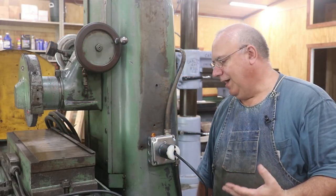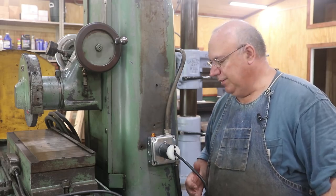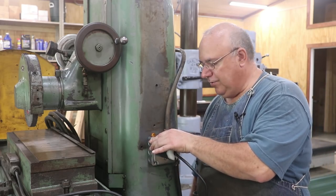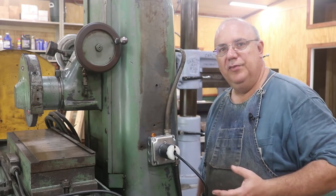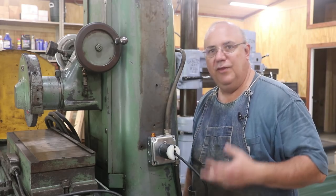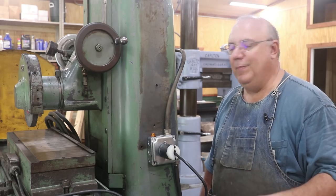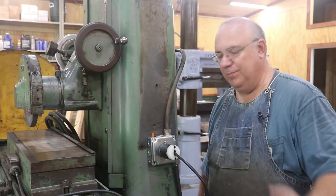First, a fairly minor electrical upgrade — something that's going to make the machine a little bit cleaner and better looking. This electrical box on the side is actually 120-volt direct current used to power my magnetic chuck. When I bought this machine, it had a huge box hanging off the side. Inside that box was a rectifier — an electronic device that converts alternating current into direct current — and the one on here was built back in the 1960s. It was just gigantic, looked like something out of a Frankenstein movie.